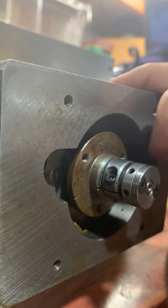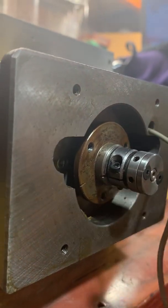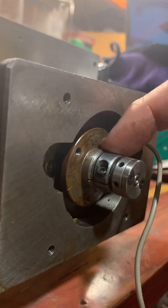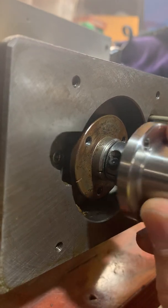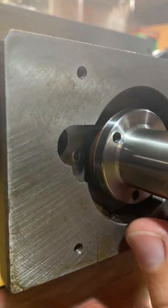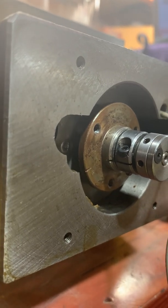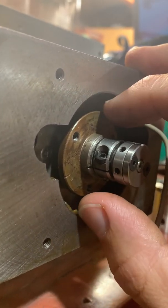With anti-backlash nuts, in order to get this to drive direct and maintain the backlash adjustment, there's a turned shoulder — turned to a nice fit — that drives via three M4 cap head screws. It's very small, but the whole machine is small. This used to be a plastic 60-or-so tooth gear from the factory, so I'm not too concerned these will give problems.